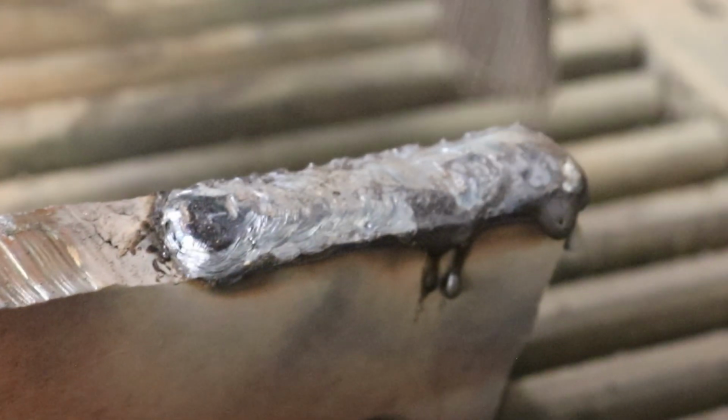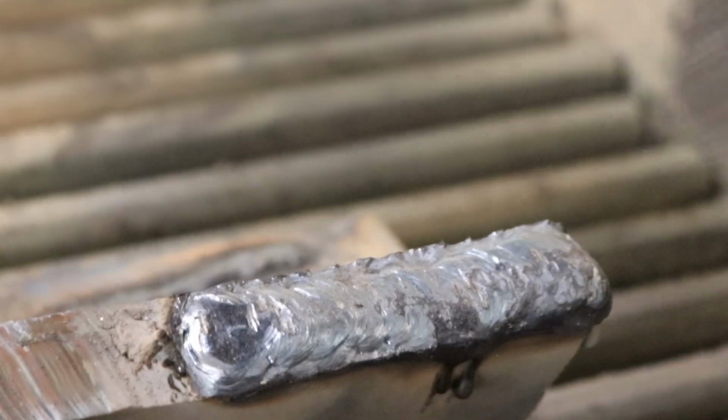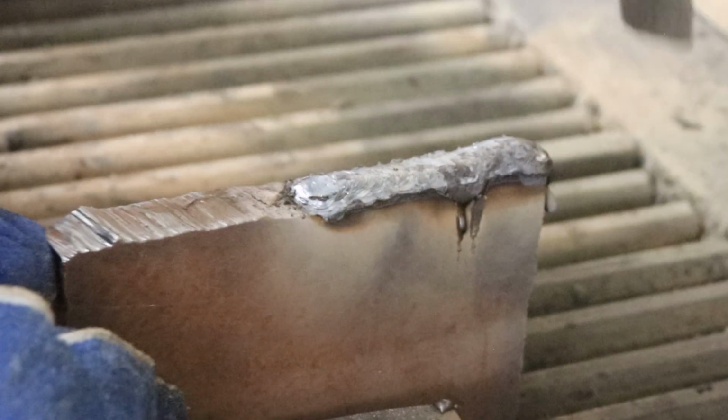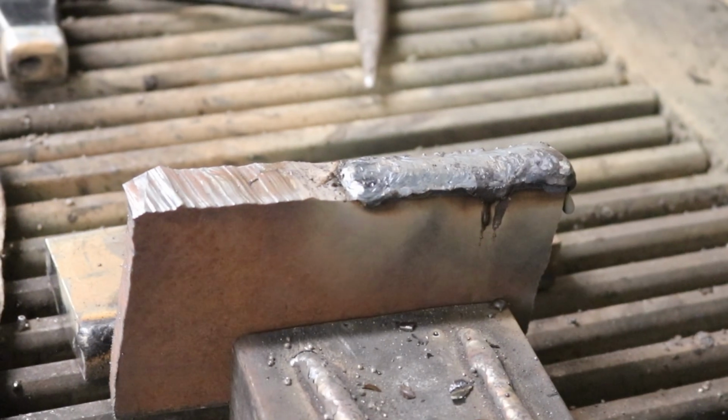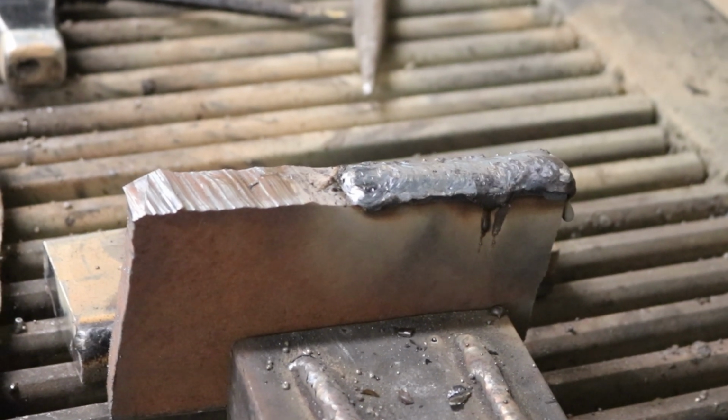This 1/8 chunk of steel, that's exactly how you'd build up gear teeth on a ditcher, splines, and there you have it. A very clean build-up alloy. Now you could put anything over top of that if you needed to. Any type of hard facing.